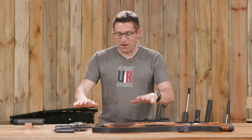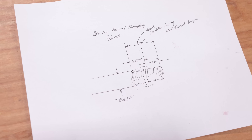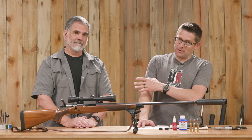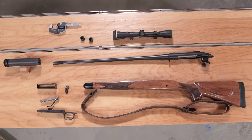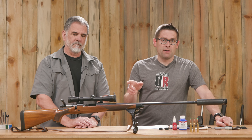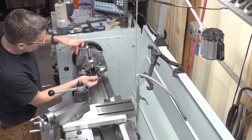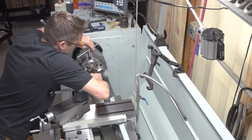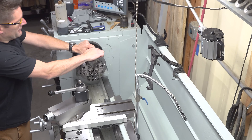I'm going to head over to the lathe, get this barrel dialed in and we'll get to work. So I had a slight change of plans — it turns out Guy Miner came by the shop. He had taken the rifle apart. The trigger was still on the barrel to action, and with this Precision Matthews TL1660 I've got an over 2 inch bore — I can get that whole barrel to action inside the spindle if I don't have a trigger hanging off. So I removed the trigger. I installed the barrel to action in the lathe. I'm using the Truebore alignment system from Straight Shot Gunsmithing.